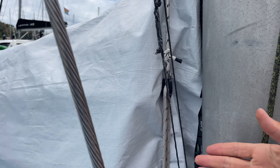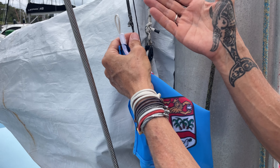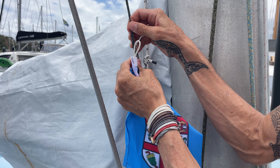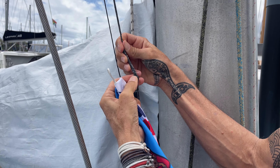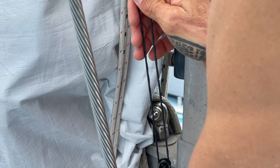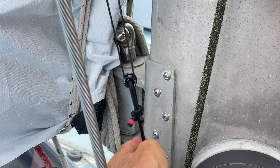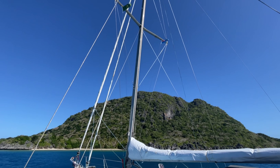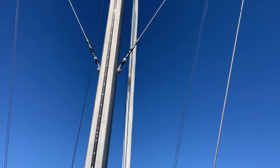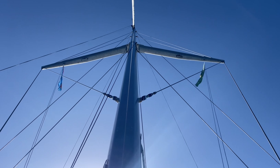And here we have the world's best flag halyard. You can see it's made of two mil dyneema — we have a lovely friction ring, a little bit of shock cord here which keeps the luff of the flag under tension. We don't like stainless steel fittings or little clips, so we've made little rope loops as explained earlier. There's a little bit more tension on that, and that's why we have the strap. When you put a flag up the flag halyard gets longer, and then you hoist your flag. We've been using this now for a couple of weeks and it's been working perfectly.